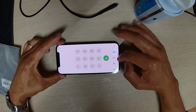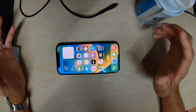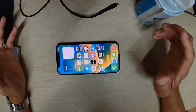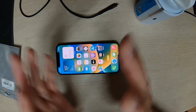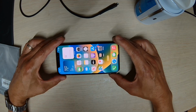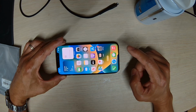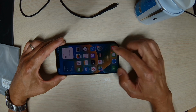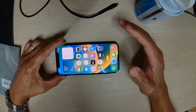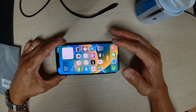So this phone was dropped, and the board got separated, and also the customer was trying to update the software when the board was separated. So we tested, and the IMEI number was not there anymore, and it lost service. So basically, we rebonded the board and restored the software, so we get cellular back.